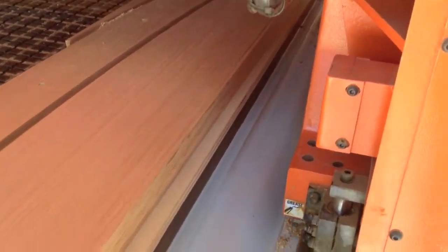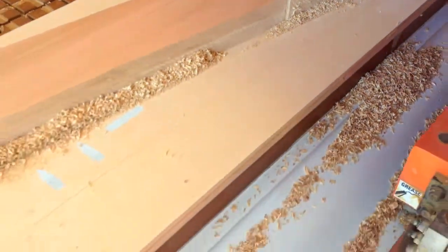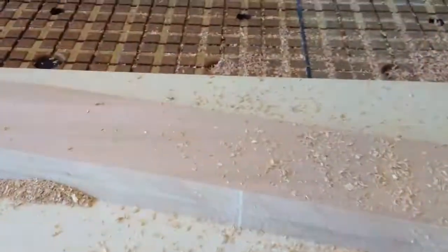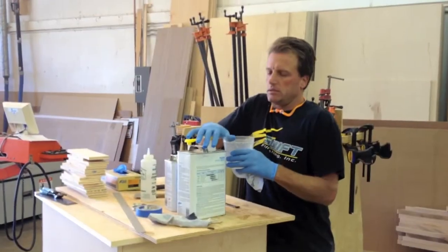Once it's all through, we clear the waste off — that 32nd of an inch we're going to take with the finishing pass. Then the finishing pass comes along and it left this little mark — you'll see in a second — but we figured we'd grind that out and it wasn't worth trying to figure out what that was all about.